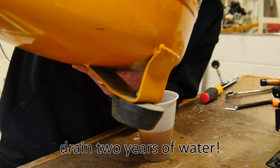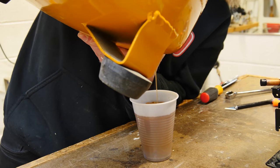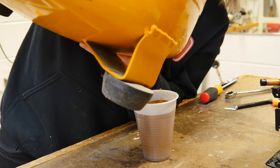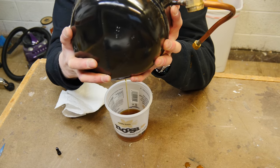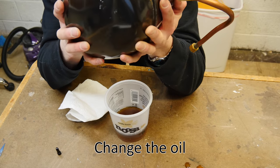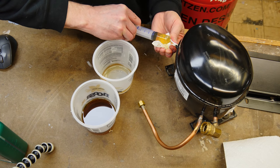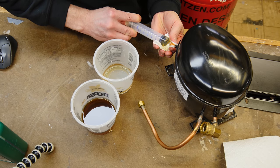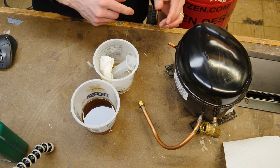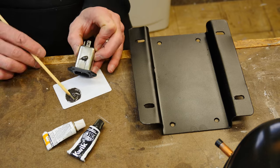Two years of water in the bottom of this tank filling up this cup — that's amazing. The drainage hole was not on the very bottom of that tank, rather a little bit on the side, and I had a pressure relief valve there. It didn't cause any issues since it's brass, but the water certainly built up in the tank over time — that's probably the biggest enemy here. A lot of people ask about losing oil out of the compressor. That's not the case — I had pretty much exactly the same amount of oil as when I originally filled it. I dumped it out, checked the old video for the level, and we put it back in — about 175 milliliters.